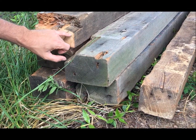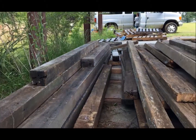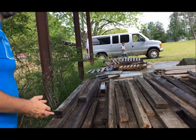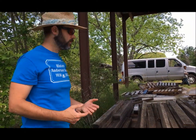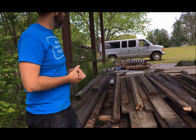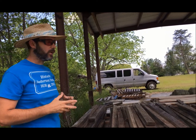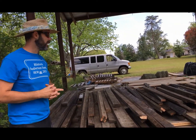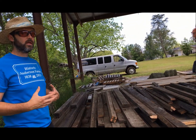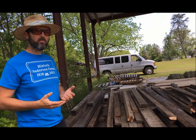Throughout these boards you'll have a mix — some will have more heart, some a little less. We've got big four-by-sixes, four-by-fours, two-by-fours, two-by-sixes, and two-by-eights, which we'll be using for a lot of our foundation work. You can also use treated lumber, however this heart pine will actually last far longer than treated lumber, assuming you have a high heart content in your board.